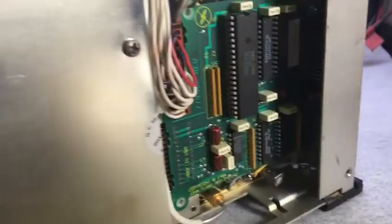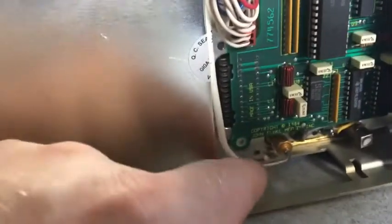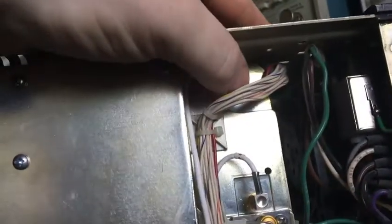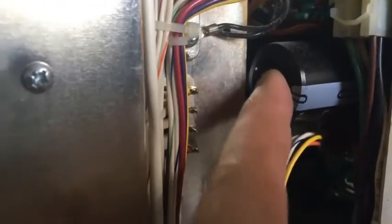Okay, so I've got the bottom cover off now. There's a GPIB board stuffed in there. A little IF connections here going up to here. Got a little push-on ones, they feel like they're fine. They're pushed on okay. Here's the other capacitor I was trying to feel, and it feels okay. I'm pushing the plastic cap and it goes down, so I think maybe they don't all need doing. This one here does need doing, so if they're bulged out, they're going to change them basically. There's a little plug in here, it feels okay.